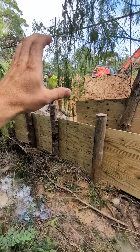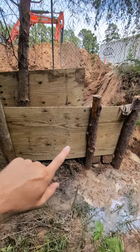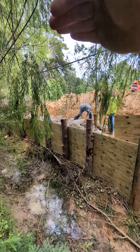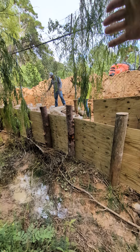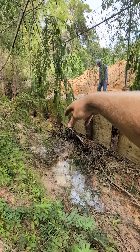In this case, they were losing their fence — as the bank was dropping off, the fence was just falling and losing ground from under the post. You can see that one right there. So now what we did is we're working over the fence, we got our posts in like this, and then we excavated on the back side to pull up our dirt.